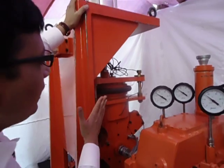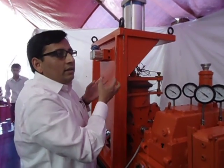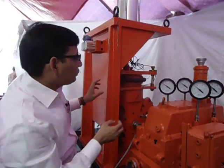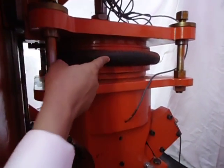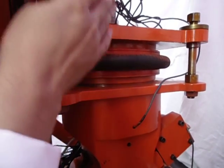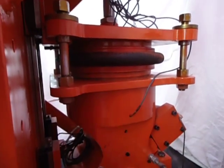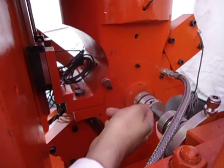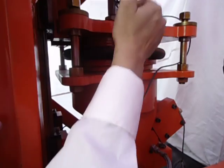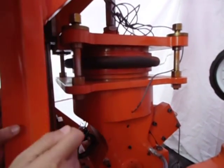What you see here is the heart of the system — the bearing loading assembly. This is the key part of the endurance test rig. We have provision for vertical loading of the test bearings using a pneumatic cylinder, which can apply vertical load up to 25 kilo Newton on each test bearing. In the current configuration there are two test bearings on this shaft and two support bearings.